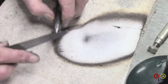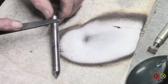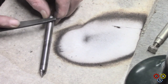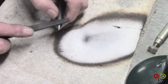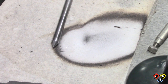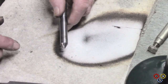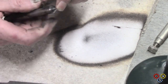The file is working on the untreated area. I was wondering whether you could hear the sound difference. On the treated area it can just about make a very slight mark, but it's not actually cutting. Then back here on the untreated area you can see it going bright. So there you are, that's all there is to it. From choice, if I'd had the oxy flame I'd have gone beyond cherry red — gone towards orange actually — but we've got a bit of treatment there.